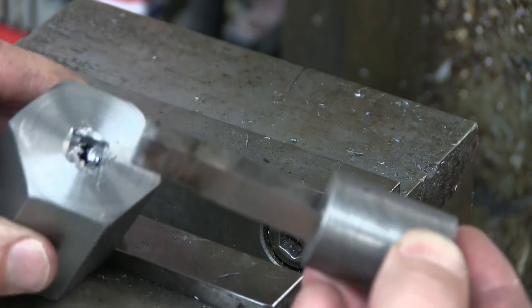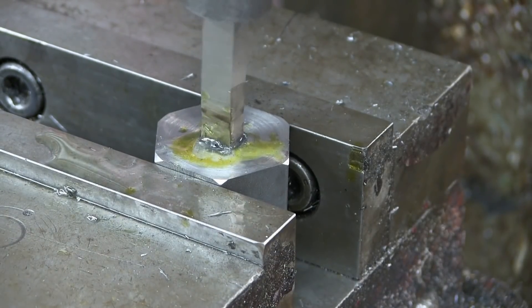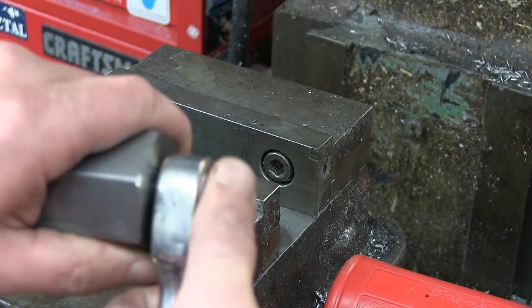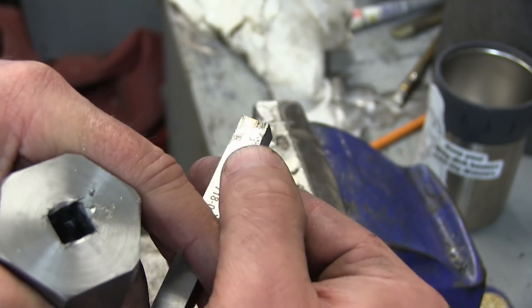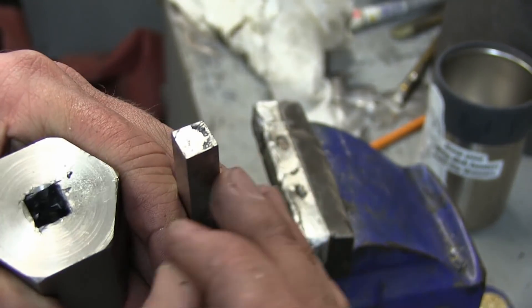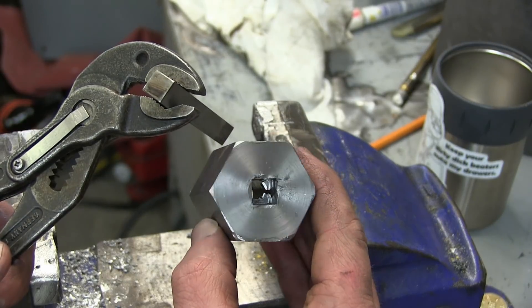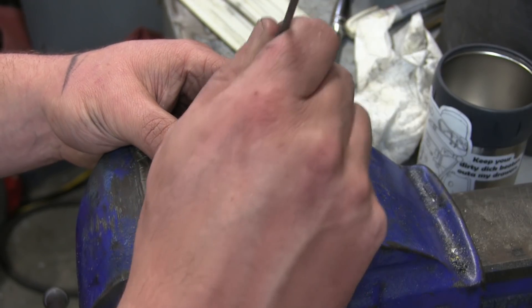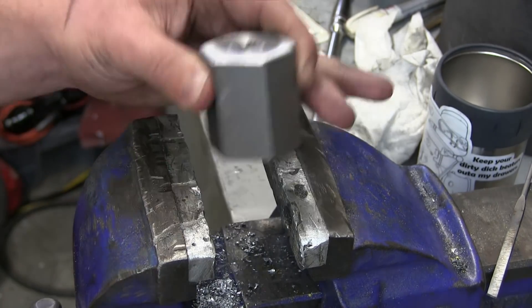Commercially these things are pricey as hell, but you make them on your own and they work about as well as you see here. I went back through there with the three-eighths and she's a little bit tight — first time tight, second time all right. I'll show you a trick for enlarging a hole. A little detail on the grind: because the grinding wheel is round, if you just turn it around you'll get a hemispherical grind, which is good enough to make a chip come out. Now we'll heat this up and do the same thing — she's hotter than a two dollar pistol and took a fair chip out of her. So now that should have plenty of clearance to slide in easy. Your old pal bumblefuck still got a couple surprises left in him.